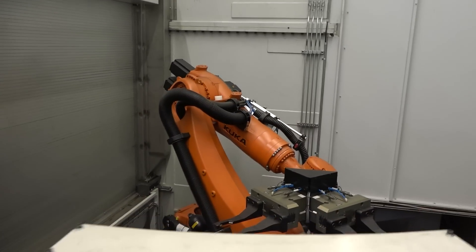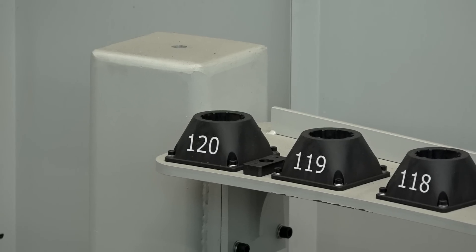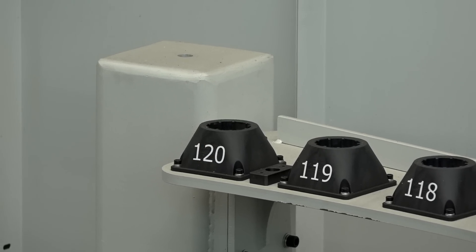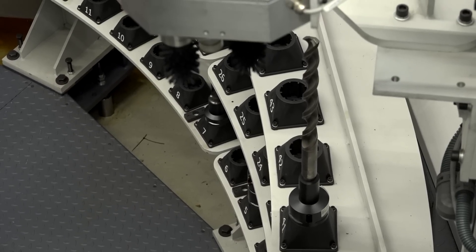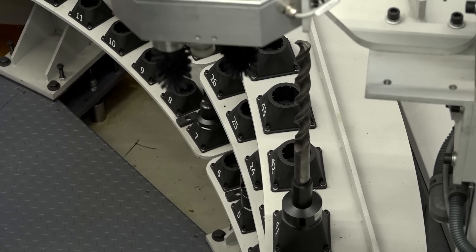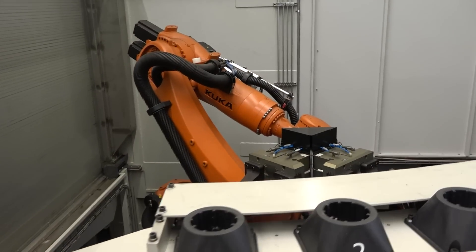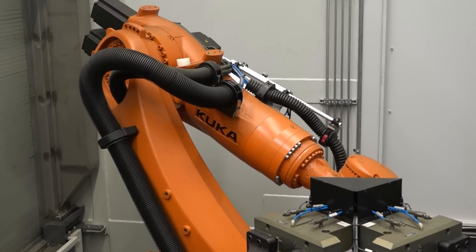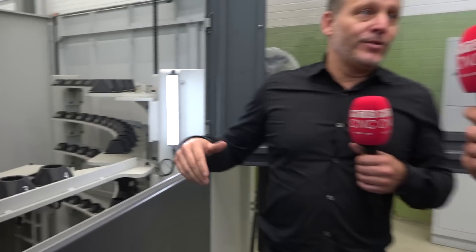What's special about the tool changer? Look at this fantastic tool changer — we have 120 pockets right now, and you're able to increase or reduce that depending on which tools you bring in. You have this KUKA robot that is very easy to teach for the customer, and it's maintenance-free because nothing moves except the KUKA robot itself. Easy to re-teach after a year whenever necessary.